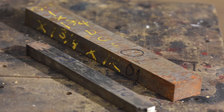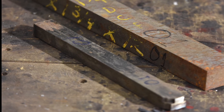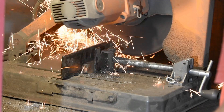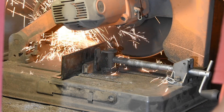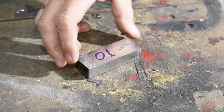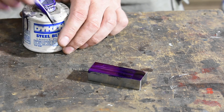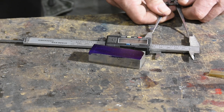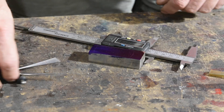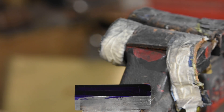I'm using this piece of really rusty old precision-ground O1 steel that I had lying around my shop. O1 is a useful steel to keep around because it's very easy to heat treat. You could make this out of mild steel and not heat treat it, but the tool is going to lose its precision and wear out quicker that way. I'll cut it to length and then mark the hole locations using layout fluid.